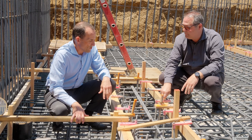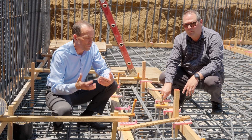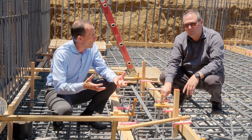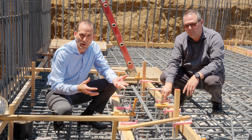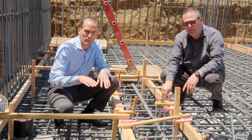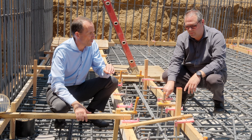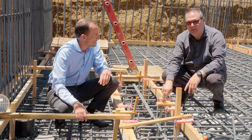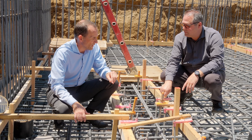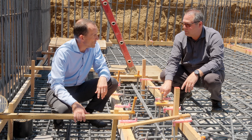This is all fenestration here — all doors. So really, again, an example of how just looking at the materials that we're using on these projects and paying attention to what our options are: getting rid of thermal breaks, getting rid of structural steel, lowering our embodied carbon, lowering our operational carbon, lowering the potential for any condensation that happens on the inside of the building, and lowering the price — can happen just by being really, really diligent about making sure that the materials we use are the ones we have to use in these projects.